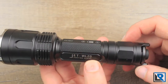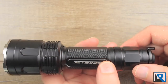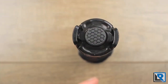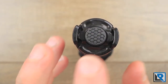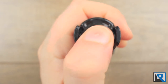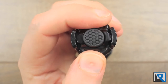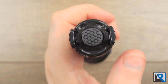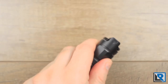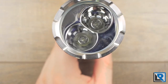The rest of the head has some milling for heat sinks and the area milled out provides a bit of grip when you turn the body. The body below is much smaller with some knurling and six flat areas, with two of those flats milled in further with all the markings in place. The tail cap has one main on-off button that stands proud and is textured with a rubber grip — it's a pretty stiff button and can be used as momentary or full on-off. Next to the buttons are these patented paddles that toggle back and forth; they are metal and don't have a ton of grip. These are used for mode selection and act as pure momentary switches. The light doesn't tail stand due to its proud tail cap and top-heavy configuration.